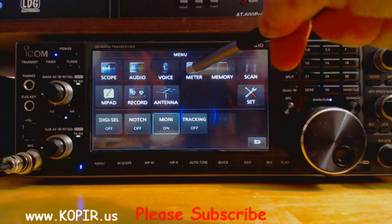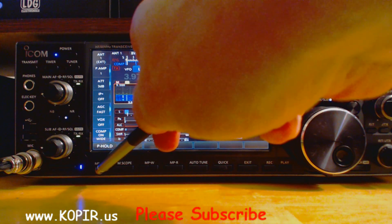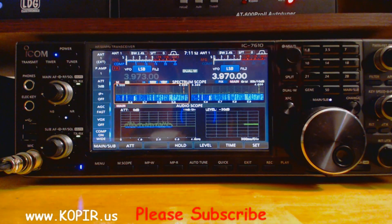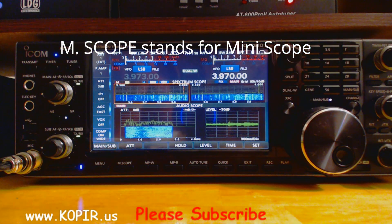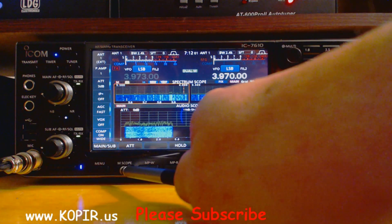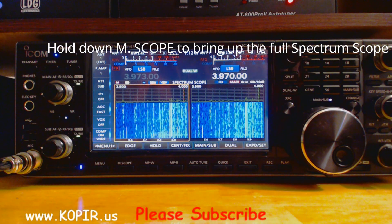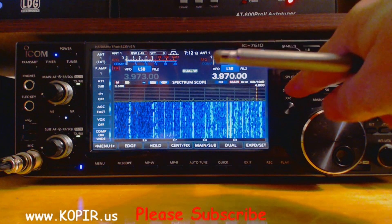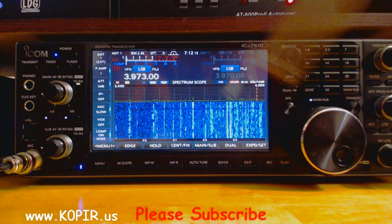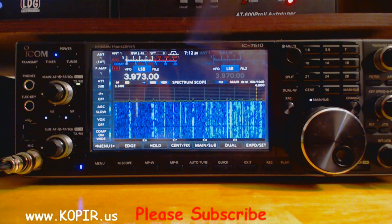Let's take a look at the meter with the dual scopes. That's just fantastic. Let's take a look at the audio with the dual — these are the mini scope. If I want to bring back up the spectrum scope, hold it down and I get the spectrum scope. I can turn off the dual. Turn off dual watch. Notice the meters have changed — this is different than the default.